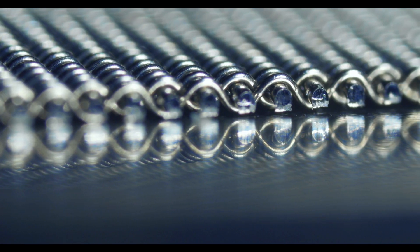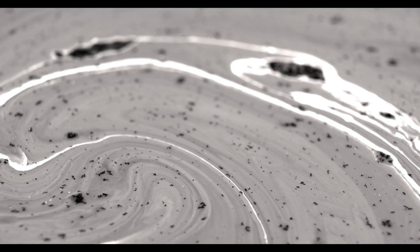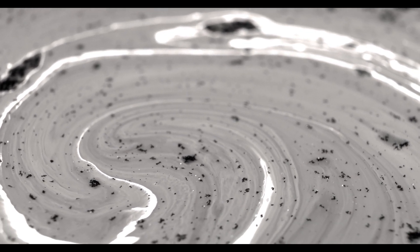There are two main ways stainless steel wire mesh reduces cost in this industry. The first is the available options with wire mesh in terms of weaves. These different patterns and weaves can allow more ink to be deposited in one pass, eliminating the need for multiple passes for each print. Each time a pass is needed, there's a risk of not having it line up precisely with the last pass, and it's just spending more in time and ink or paste. The second cost saving benefit is when you're using very expensive ink or pastes — the wire diameter is critical to reducing costs. Stainless steel can use a very limited amount of paste to transfer, and can be made with very thin individual wires that still offer very high connectivity. When the amount of paste needed can be reduced to such an exact amount, this can save companies using expensive paste like silver in the solar industry significant money.